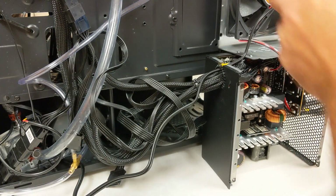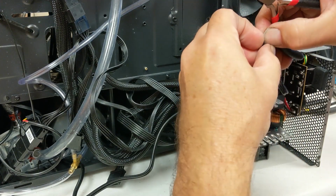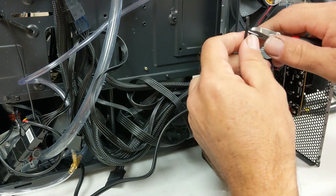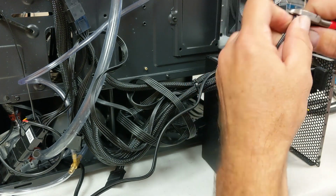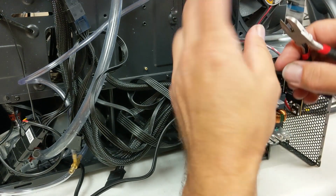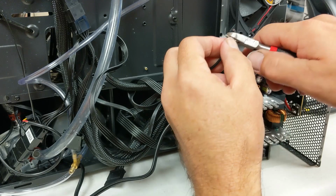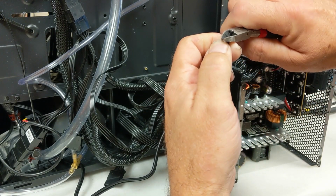It should go without saying, but please make sure everything is unplugged before cutting. The air pump I bought has a standard 120 volt input. If you buy an air pump that has a power adapter at the plug, do not clip the thin cord and wire it up to your power supply. You'll definitely get smoke. Also, this may be a good time to mention that I'm not responsible for anything I have already inspired you to destroy.